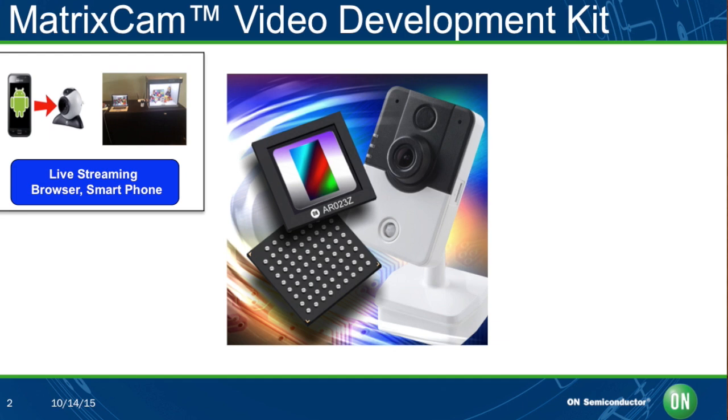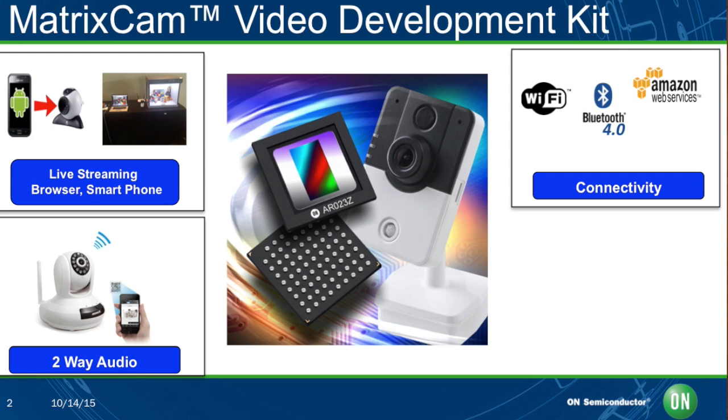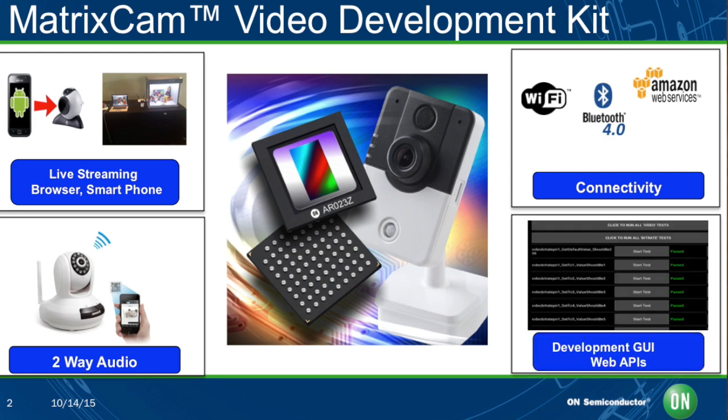It's got sensors, which includes a CMOS image sensor providing the image and video functionality, and a motion sensor. It also has both wired and wireless connectivity covering Ethernet, Wi-Fi, and Bluetooth Low Energy. Additionally, we also provide audio capability and live streaming to a mobile device. The board supports cloud connectivity right out of the box with options for live streaming or cloud storage. We also offer a web GUI for configuration and control of the camera. The kit comes with a complete set of instructions, and it literally takes less than 10 minutes to plug and play.